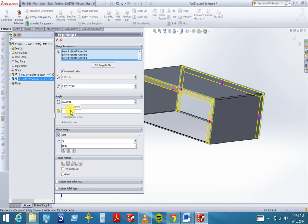We did not. Because that's where the screws are going through, through the flange. Yeah, and that's why we don't want it adaptive, because we chose a half inch such that that number 4 screw with its head could sit in the center and have enough material to be big enough, but not too big. So, if you notice, they're the same. Okay. We didn't want those flanges to adapt. You don't want to end up with a box that's got a flange that's 4 inches out here. That's goofy, right? So, in this case, we hard coded that at 0.5, I believe.